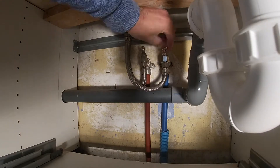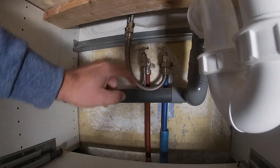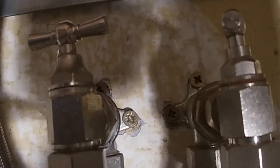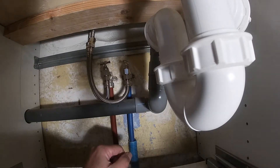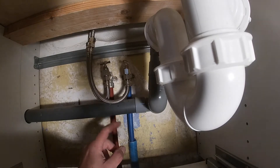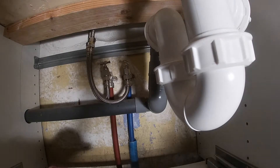So I'll turn this off. It's leaking just round the spindle there. So if your tap's been on for years and years and then you suddenly decide to turn it off one day, well, that's exactly what can happen. But there is some good news. If you swap the tap and turn it back on into the old position - so fully open normally - there's a possibility that it will stop leaking because it's used to being in that position. So don't worry too much about that yet. Likewise with the isolating valves - we will see if when we open this up again it stops leaking.